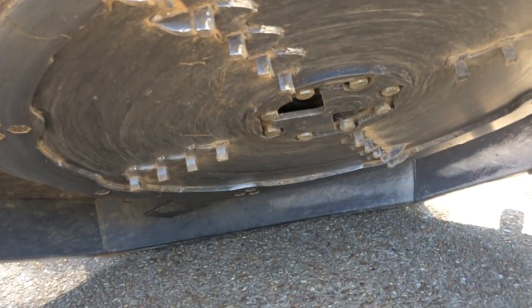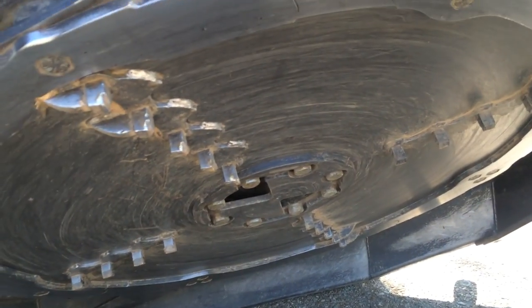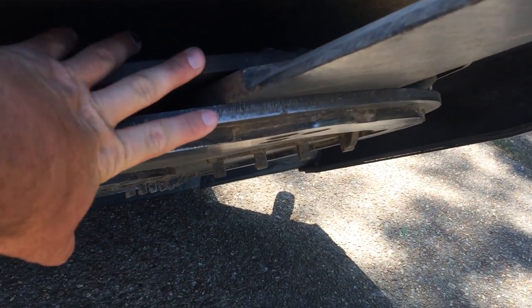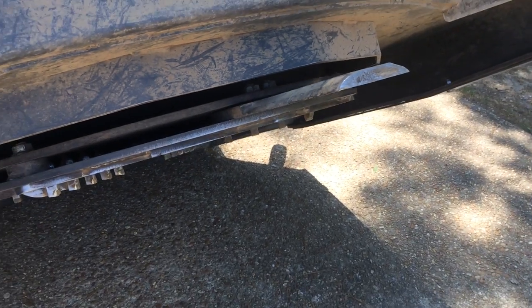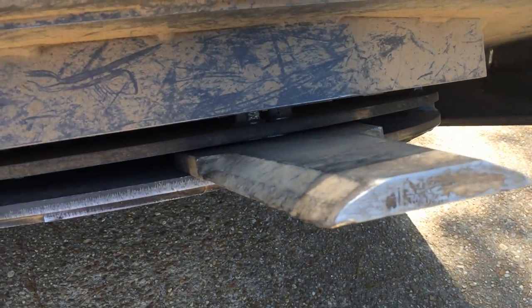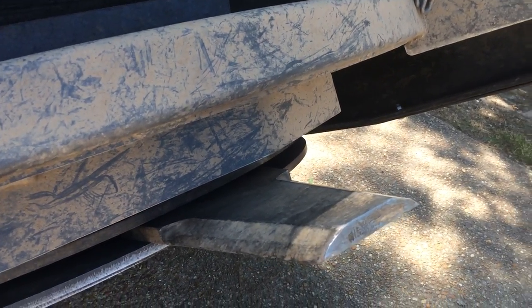It has 18 stump-grinding carbide teeth underneath. The blade carrier weighs about 600 pounds with 18 teeth and four knives. There are spacers that hold the two sides of the blade carrier apart, also with a 3 and a quarter-inch bolt going through them. One thing I like is that the blade bolts are held in double shear — meaning the bolt passes through two pieces of metal with the load in between — as opposed to a traditional bush hog where the blades are held on in single shear. These also have a 3 and a half-inch diameter puck of metal that the blades go through, so the bolts are not experiencing wear from the blades swinging back and forth.